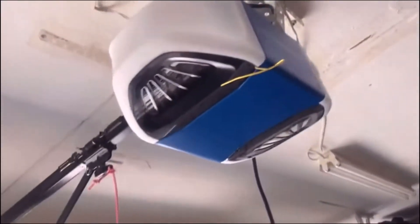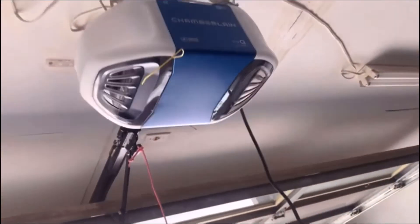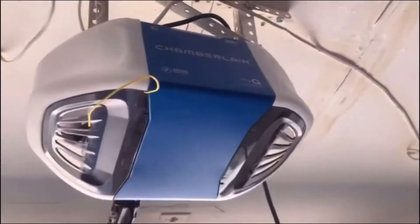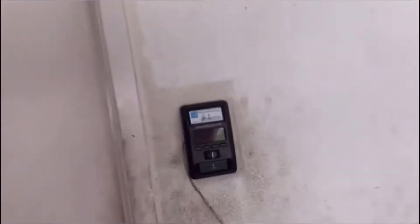You have a battery backup that uses a 12 volt DC battery to run the motor slowly, which is efficient so the battery can last up to 24 hours. There's a voltage regulator in there that monitors how much battery is left, and it communicates with the control panel to show the battery status of this garage door motor.